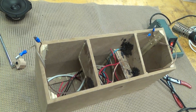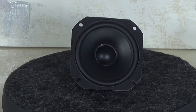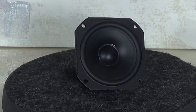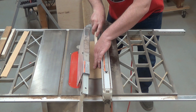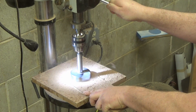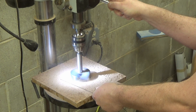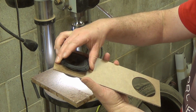Now it's time to cut some panels for the front of the radio. Since the speakers have kind of a weird shape and I wanted to recess them, I ended up using two pieces of wood for the front: one quarter inch piece with regular round openings, and an outer thinner one eighth inch piece. Well, why don't I just show you? You're smart, I'm sure you can figure out what I did.